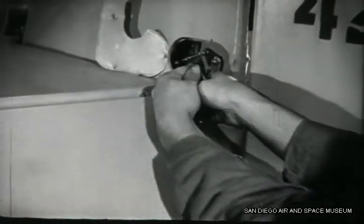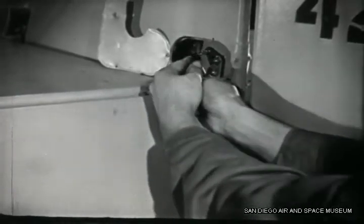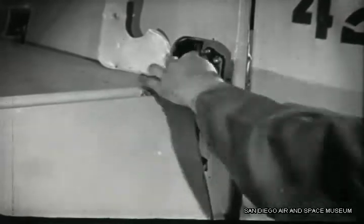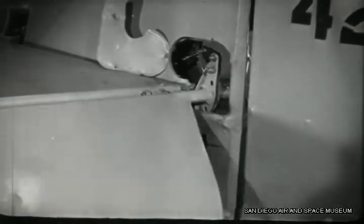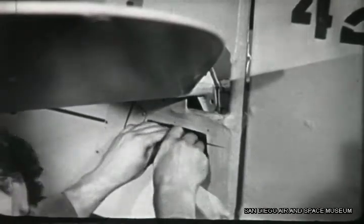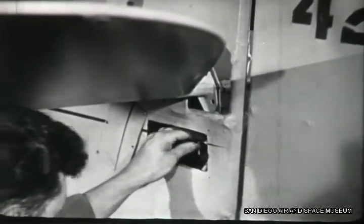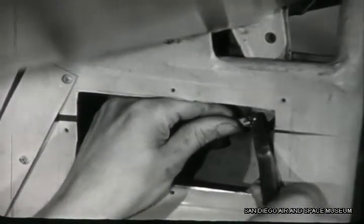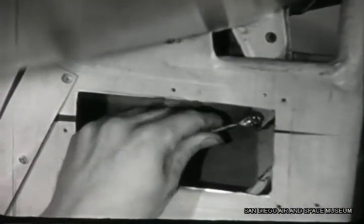When the nut is on and cottered, the turnbuckle must move freely. The other cable is connected the same way, but here the safety wire is usually off the turnbuckle because you have to remove it to detach the cables easily. When you're sure both turnbuckles are free on the horns, the alignment of the elevators can be checked with a straight edge.